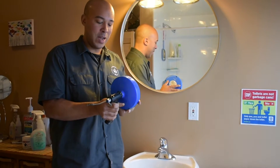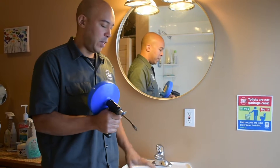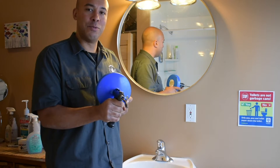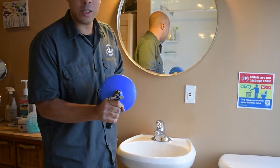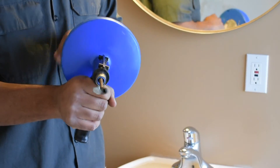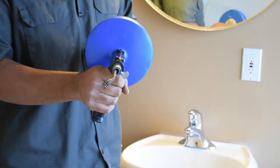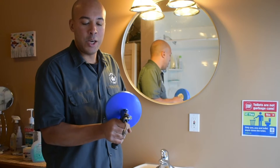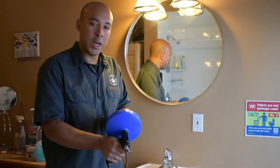This is your standard hand auger. It's human powered, so it's good for blockages that are close to the fixture itself — a couple feet down the drain is the effective range. When using it, you want to make sure you're turning the right direction. You can see there's a little swivel on the end. You want to spin the right way so you're swiveling into whatever object — generally hair is what this is going to be attacking. You want to swivel into it, screwing into the hair, so you get a good hook and can pull it out. Know which direction you're turning.